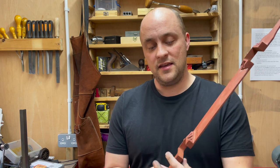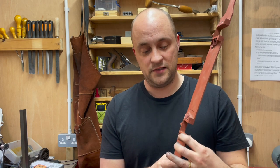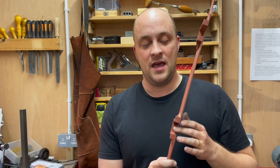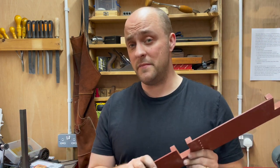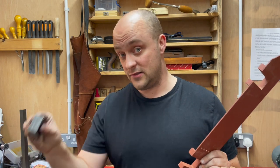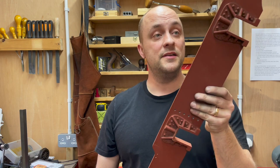But also, the thickness of the horns will determine the width of the slot on the axle boxes, and it may be that I need to match them. And the width of the horn slot will determine the depth of the slots on the side of the axle boxes when they slide up and down. So, yeah, probably the next thing to do is to get this together.